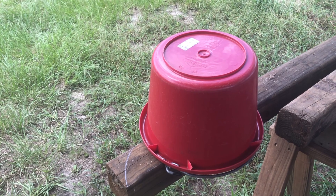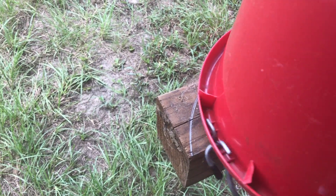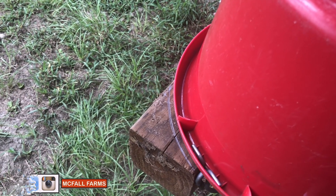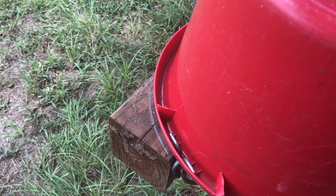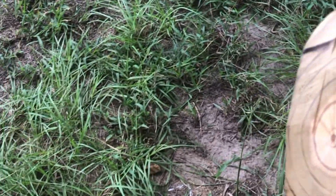Just giving it a little curvature so that when I go to drag it, it doesn't dig down into the ground — makes it slide a little easier, doesn't rut everything up. You can do this with a reciprocating saw, a jigsaw, whatever you've got. It's a three-and-a-half-inch piece of timber and I've got a cordless circular saw, so I'm going to cut basically a radius corner with a straight-cut saw — might not be pretty but it's functional. If you have goats you probably have feed buckets; I just take a bucket, get it about where I like it, make a mark, and try to follow that mark. Again, it's not absolutely beautiful but extremely functional.